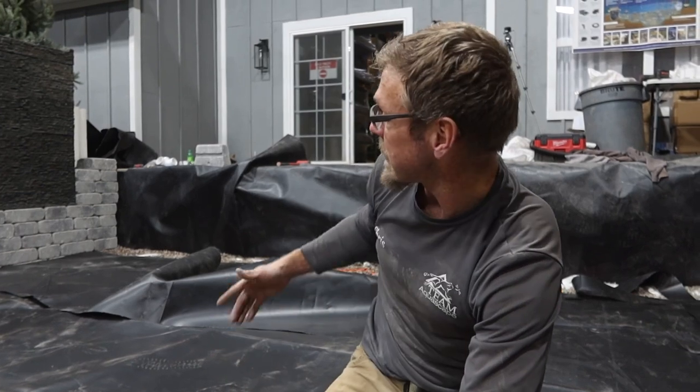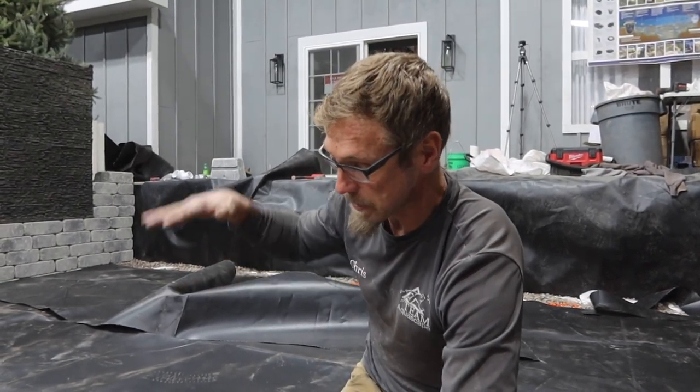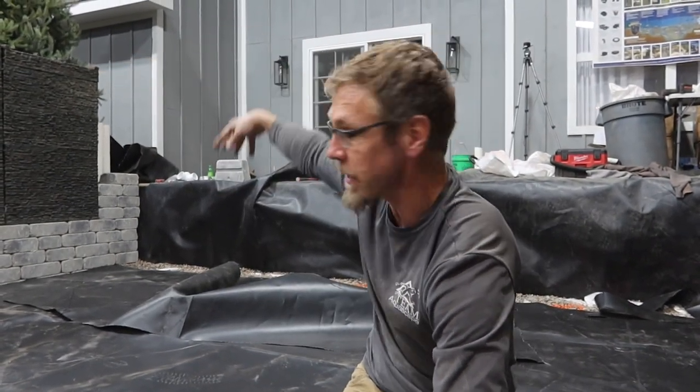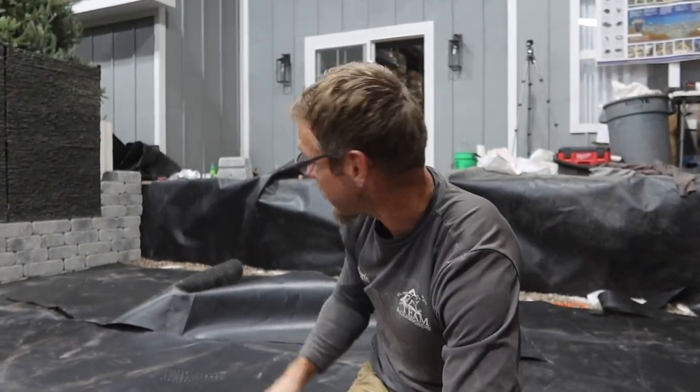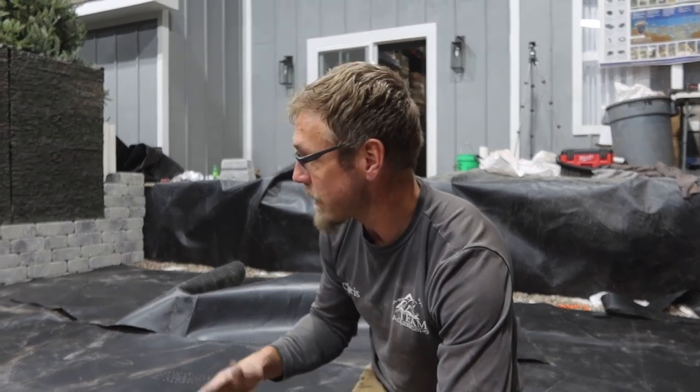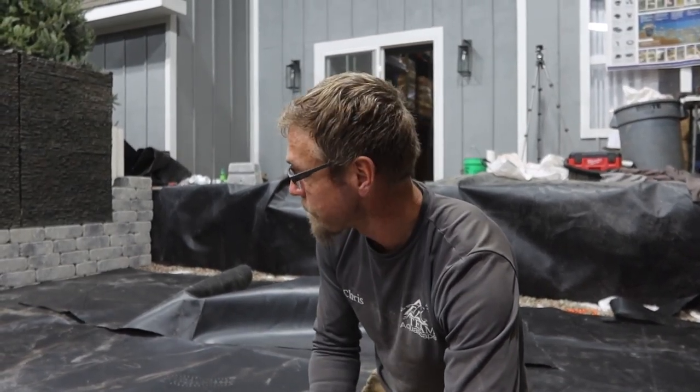What it also does is it's going to allow us to create a raised intake bay over there using our brick, our wall stone, to create our own skimmer, kind of an in-pond skimmer. So it's a really, really cool effect. We've only done it on a handful of jobs ever that I can remember. But what this is doing is disallowing the water to get lost underneath the aqua blocks, and it's forcing all of the water to be sucked in through one area, and that's going to be sitting back over there. So that's what this drop liner is doing. We still have to cover up all that gravel back over there, so we'll seam another piece on, but it's a great way for us to get rid of this scrap polyethylene and create our skimmer, our in-pond skimmer.